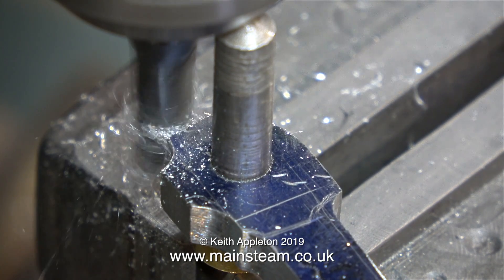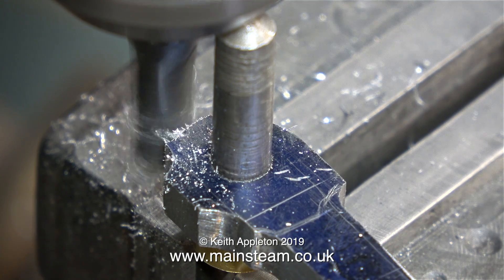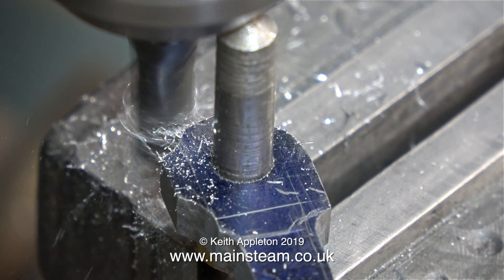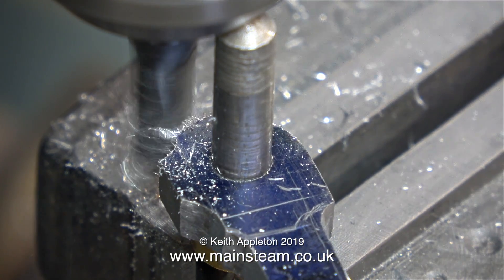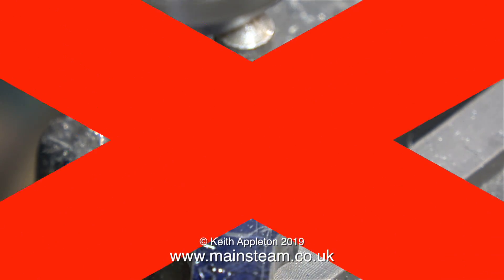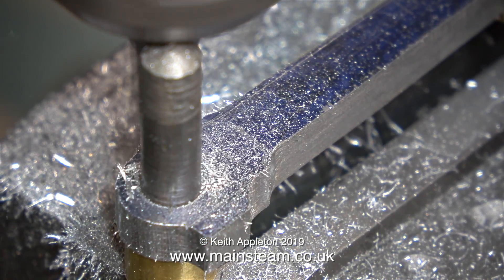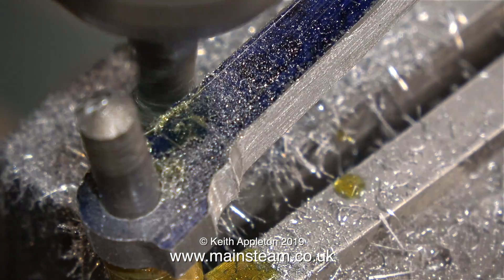The first error is like this: I am putting far too much pressure on the cutter, so the end of the rod is chattering. It is a good idea to use a proper end mill for this because it has more cutting flutes. If you use a slot drill, which has only usually got two cutting flutes, then you may run into trouble. Watch what happens when I get it wrong — too much pressure and a lot of chatter. A bit of lubrication may help, but watch — this could be dangerous.